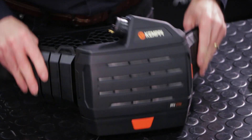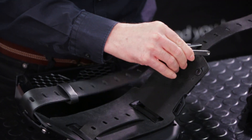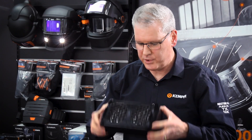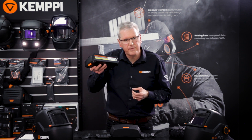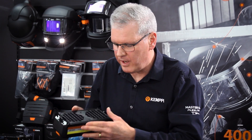Very simple and very quick — I'll open up this belt. The gas filter itself also has an excellent feature which extends the work life or runtime of the battery system and extends the life of the filter itself. We can call this smart sense technology. When you actually fit the gas filter to the PFU 210E the unit knows that the gas filter is fitted, and that restricts the maximum airspeed to 160 litres a minute — adequate enough air coming into the breathing zone, nice and comfortable, nice and cooling.